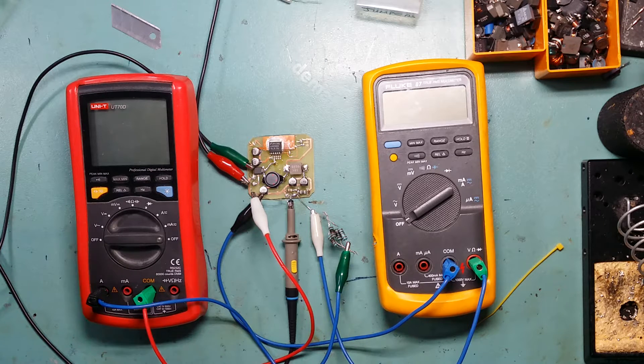If you've got too much noise, the reset pin of your microcontroller might trip and the microcontroller might continue to reset and not function properly. So I needed a power supply with very low noise on the output.